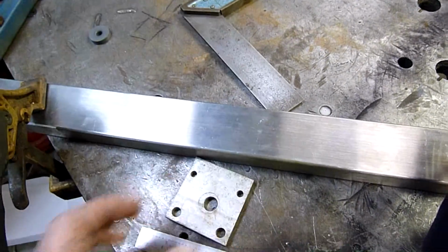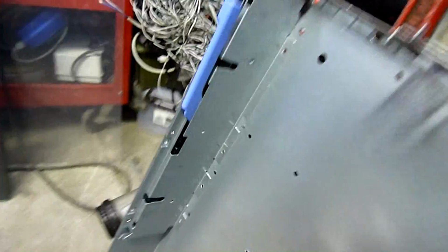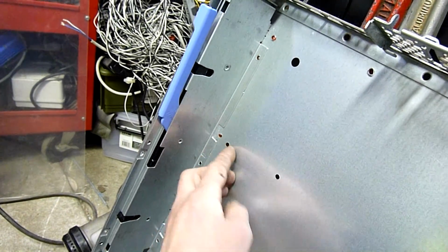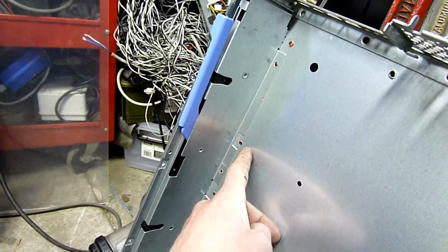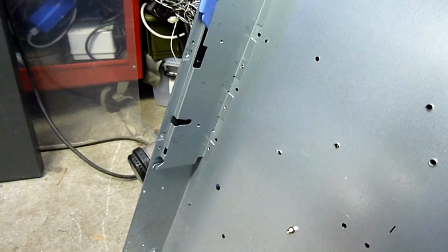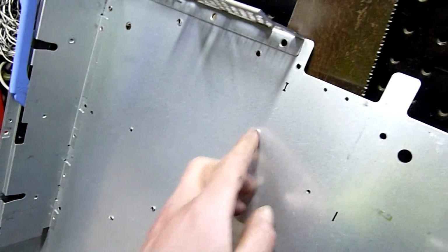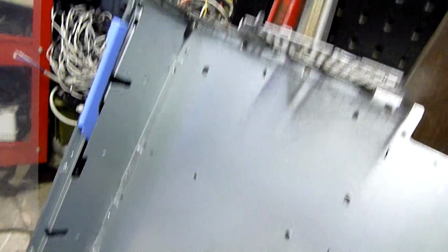I'll show you one day. It's quite handy because when I'm going to plug weld the case, essentially I'm going to drill out some of these holes a bit bigger and just take the TIG and gently fill, like start the arc on the base metal and add filler until it creates a puddle involving both the base metal and the thin sheet metal computer case.